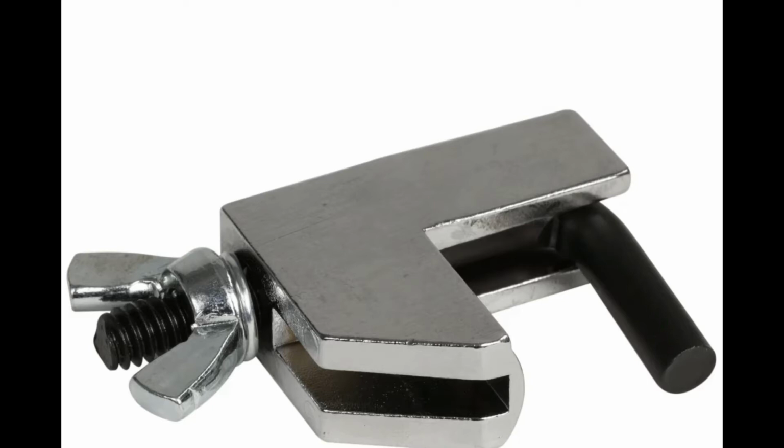Once you have the vacuum, as I said before, you insert your hose from your pressure gauge, and then you use this clamp onto the vacuum line, the one that goes towards the pump. The idea then being you can get your 5-minute drop test done. Once you've then finished your drop test, you then reclamp the resin infusion line, place the resin line into your resin reservoir, and then release the clamp to allow the resin to flow.